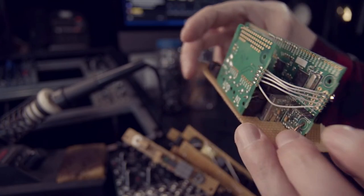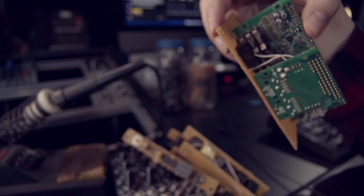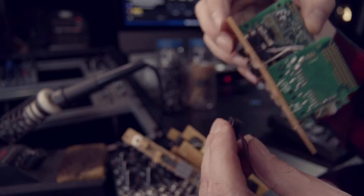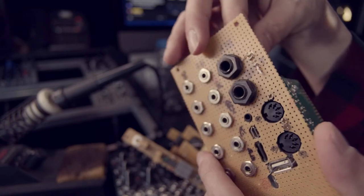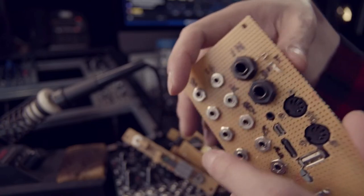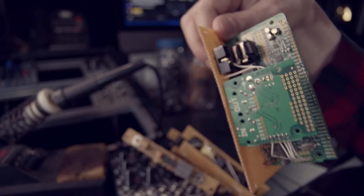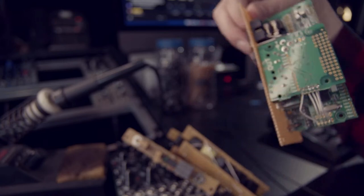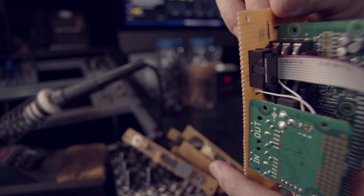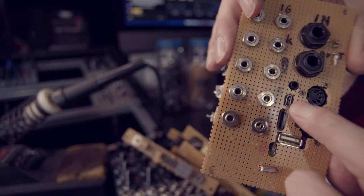So this is another area. This is also, if I'm not mistaken, I have a Eurorack power rail here. And I set that up on purpose. I believe I just used the 5-volt place on the rail. We can look behind it and see that it is not using the ones on the end, which I believe represent 12 volts. I think this is taking in 5 volts, although I could be wrong. It could be 12 volts and it's just using its regulator to take it down. But it is designed so that I can put it into my Eurorack system and just begin using it like this. And what you do is you plug into the USB thing to program it. So there is another range of possibilities there.